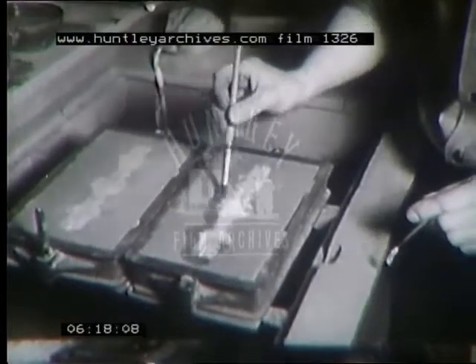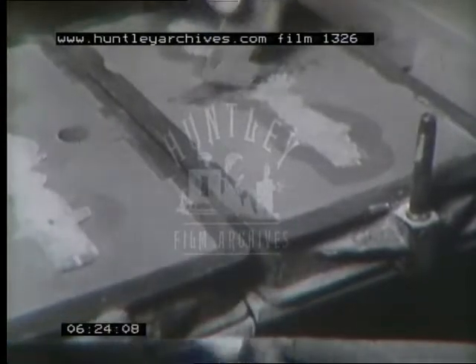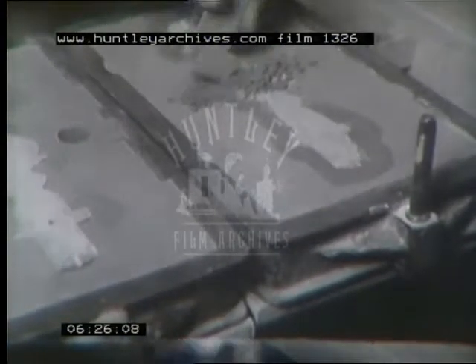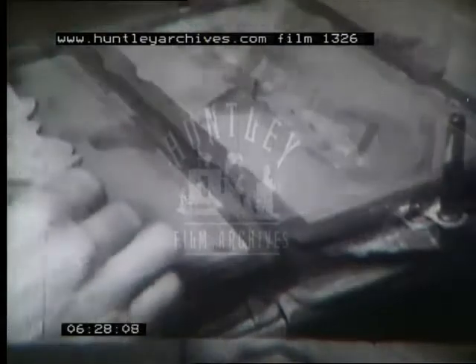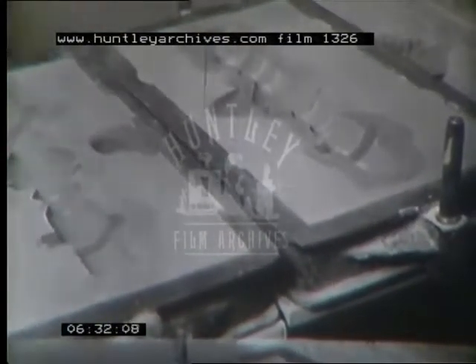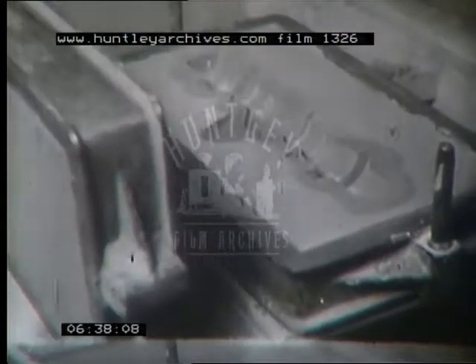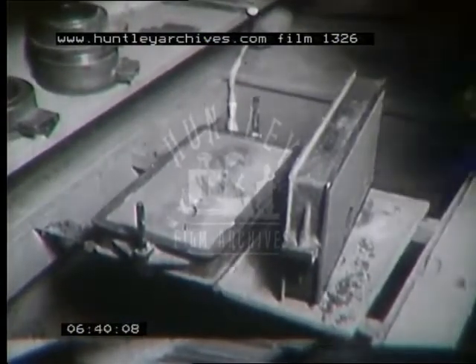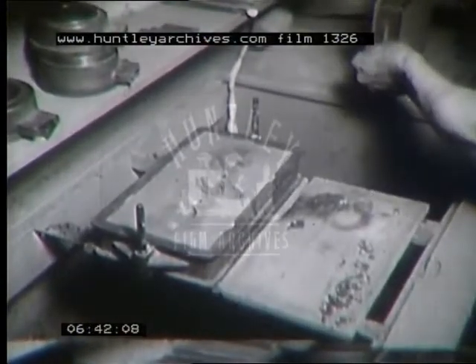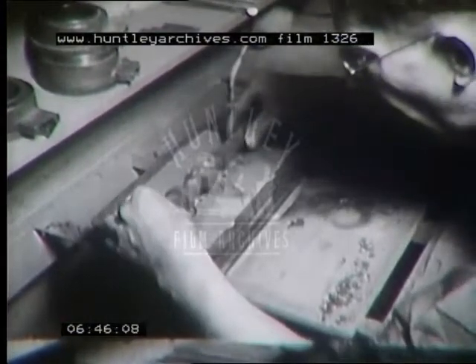The half of the mold is again temporarily put into place and these imperfections are repaired. By moistening the edges, the craftsman is able to lift out both halves of the wooden candlestick form without damage to the sand. Now an entrance for molten pewter in this half of the mold, opposite a hole called a gate in the other half. Both halves of the wooden form are removed and in the upper half of the mold preparations are made for pouring. The hollow space within now corresponds to the outside dimensions of the candlestick.